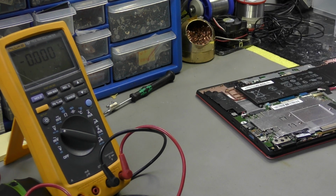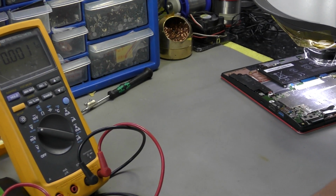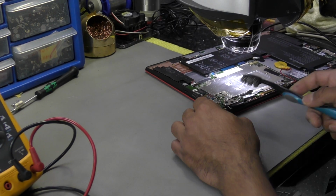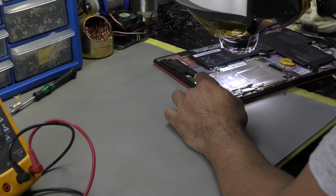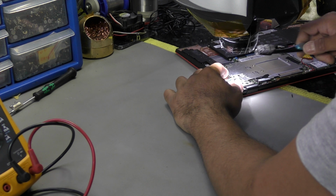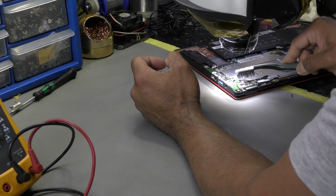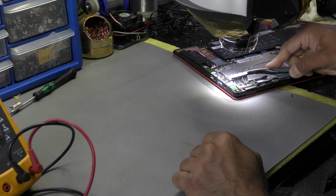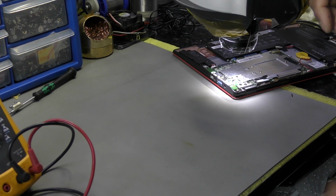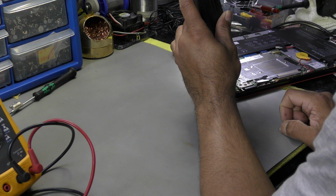Oh, just one other thing I needed to check is to make sure that the pin's got no bridging. Yeah, that's pretty nice. Right, what I'm going to do is give it a quick clean, as always, being a clean freak. Am I out of view or within view? I'm within view. It's funny when you're doing 4K content recording, the batteries tend to discharge a lot quicker versus 1080p. Okay, mate. Hopefully that will set things straight. I'm going to get my heat gun and get rid of any excess flux build-up. Just evaporate that. That'll do it.